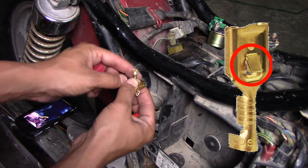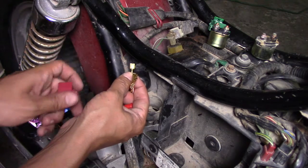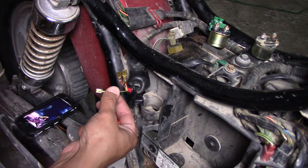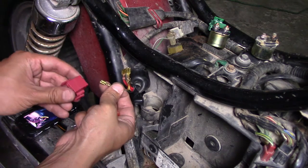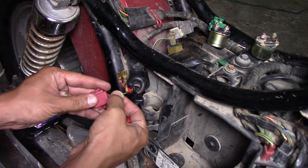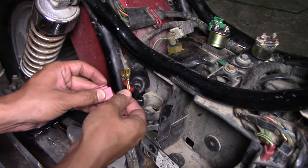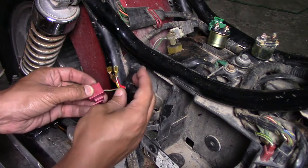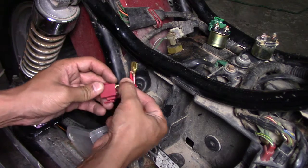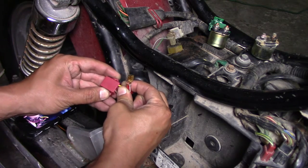Those tabs are actually what you use when you take the connectors out of the plug — you use a small screwdriver, poke it in, and it bends the tab down, and that's how you pull the connector out. I'm going to start with the easiest one: I've got a green wire and I know where that goes. I put it in and it snaps right in — you can pull on it and it won't go any further and won't come back out. Next one's going to be a yellow one right next to the green one. You put it in and if you listen closely you'll hear a little click — that means it clicked into the plug.